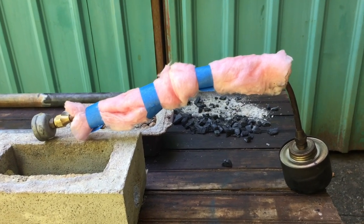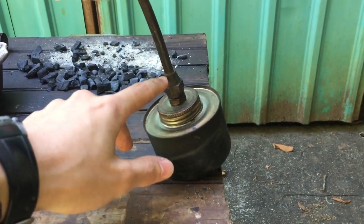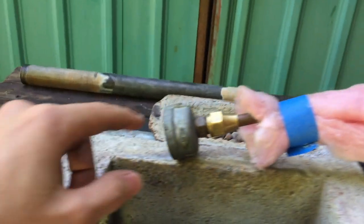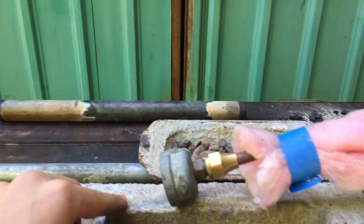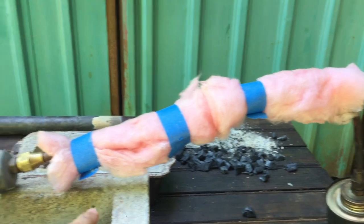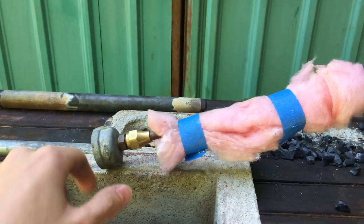This is the water boiling section. I modified an old alcohol burner to adapt to a copper pipe, which goes over to a steel cap that goes to the reaction chamber back there. I put some pink insulation to keep the water vapor from condensing as it ran through the pipe, just to minimize the amount of water in the reaction chamber.